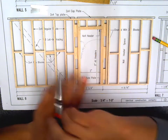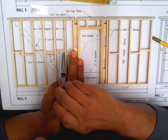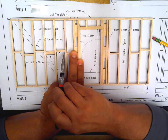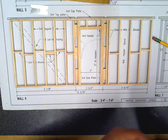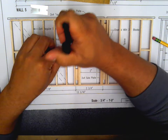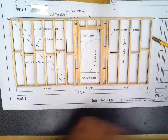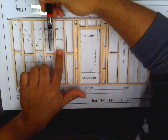The reason why you always watch where your fingers are is because in real life, when you're using the nail gun, it can ricochet, and it can actually come around and make a U-turn in the wood and come right back out. That sounds really wild, but it does totally happen. The thinner the nail, the more that happens. So finishing nails, it always happens more often. For some reason, these nails are just popping out of my hand today.